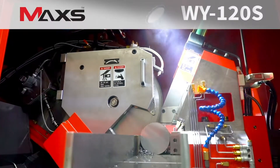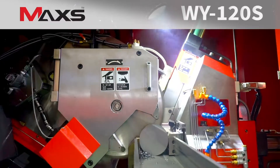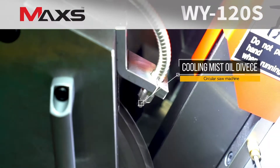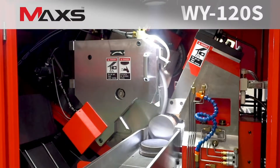In addition, a sub-motor and a ball screw are also embedded to achieve even more precise cutting. As the circular saw blade rotates, cooling oil mist is sprayed on the material and the tip of the blade, minimizing heating on the blade and materials and ensuring long blade life.